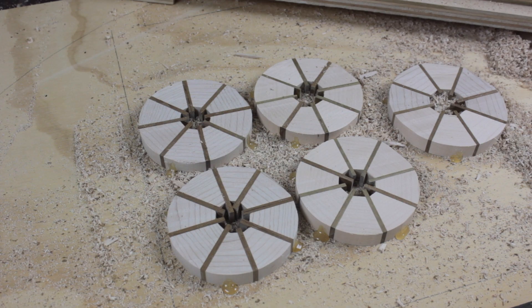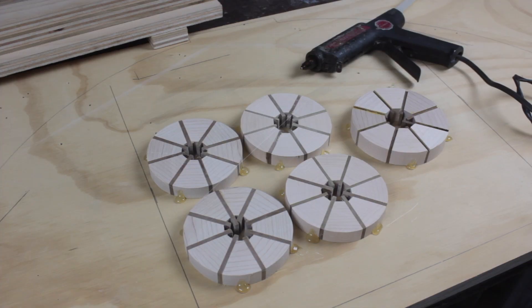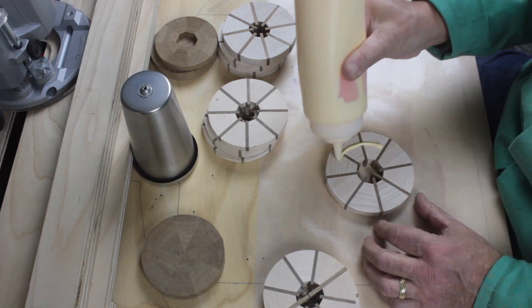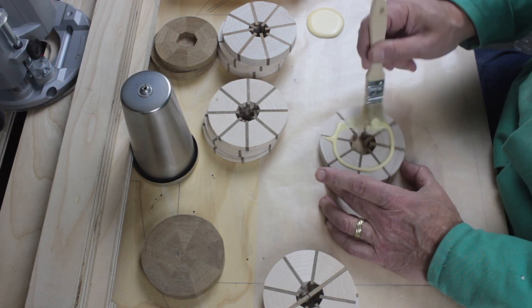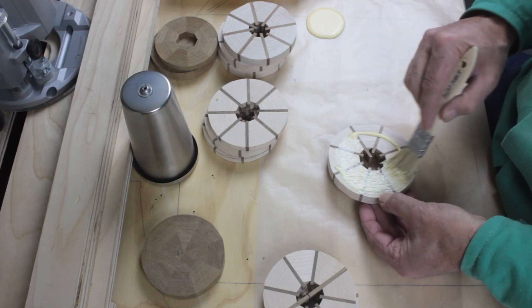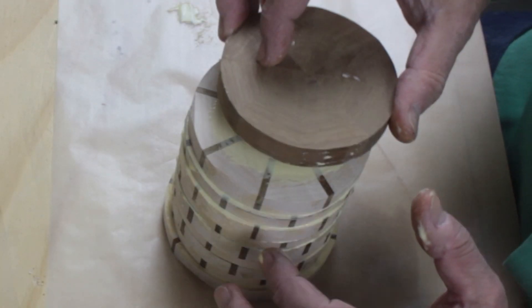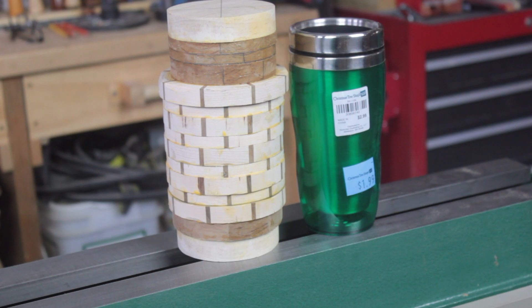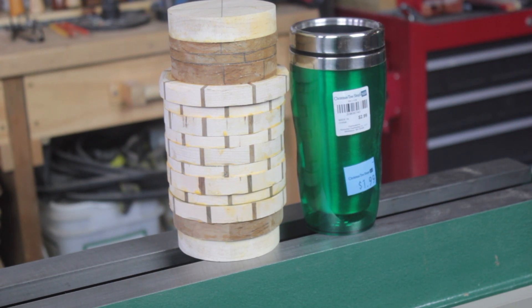To finish leveling all the segments, I hot-glued the pieces to plywood and used a router with my slab leveling jig. On wax paper, I glued all the segments together, making sure all the pieces were covered with glue. I capped the ends with teak segments and used bowl blanks to press the pieces together. I did add extra segments and pine blocks.